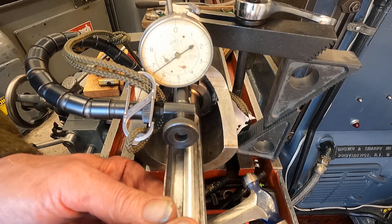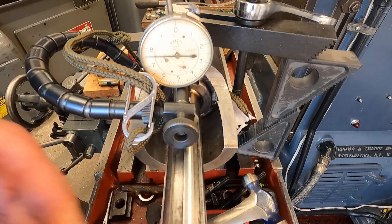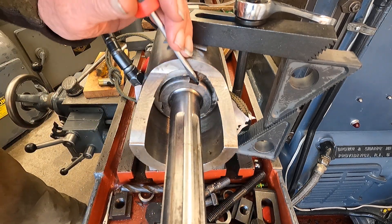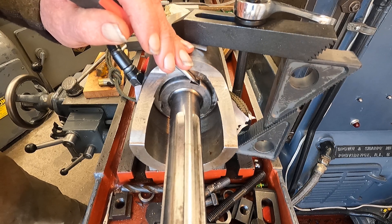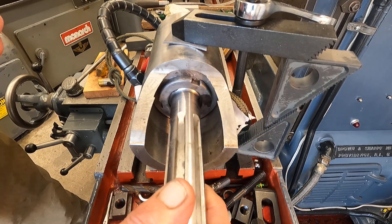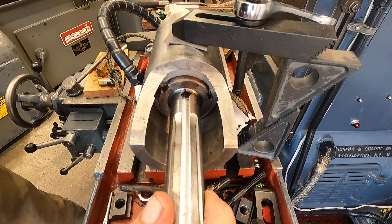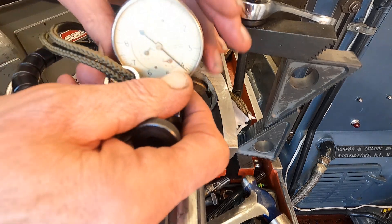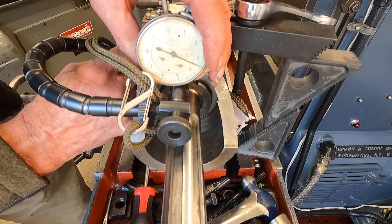Oh wow, that's pretty good. I'm going to take just a little more. This is a tenth indicator. When you run the spindle after doing this, you've got to run it at the slowest speeds for about an hour, then slowly start speeding it up. If it gets hot, you know you've got to back it off. I've got a mark here of where it was, and I can see it's a bit ahead. I think that's probably a good place to stop — just how it feels. I think it feels good, but I'm going to have to run it in.